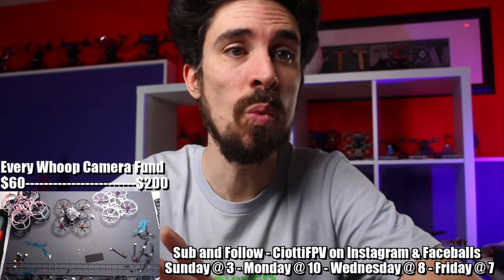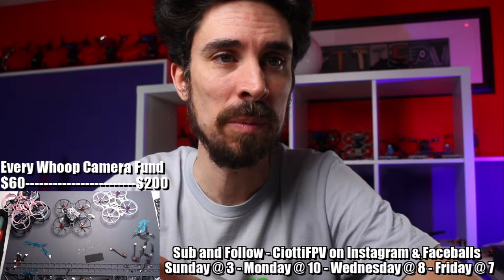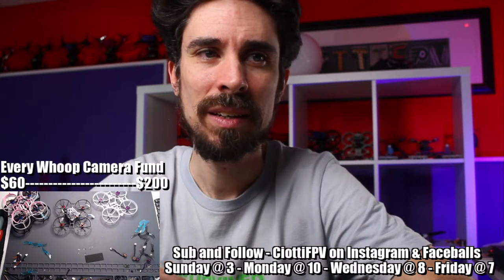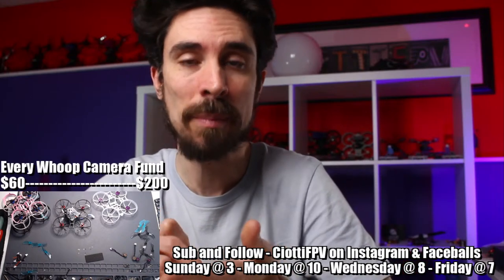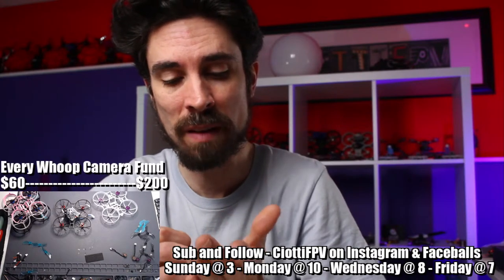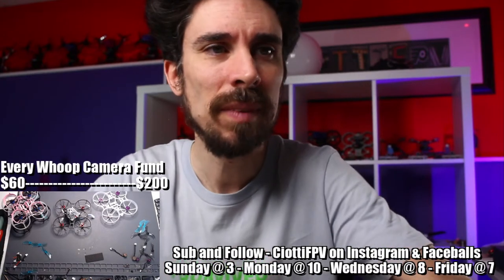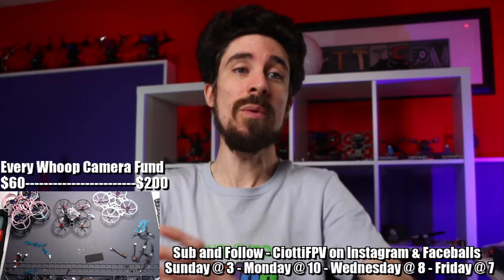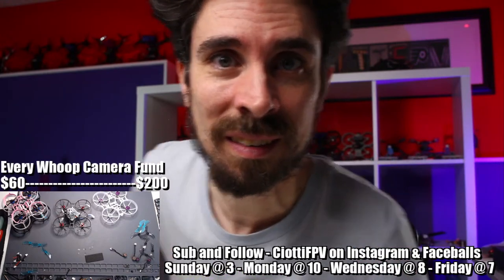Gray Hat says, HDZero claims 1 millisecond more latency than analog at 60 frames per second and 5 milliseconds less than analog at 90 frames per second. That's a silly claim because analog latency is all over the place. It depends primarily on what camera you use. There are analog cameras that'll have 30-some milliseconds of latency, and other analog cameras that have a couple of milliseconds of latency. Walksnail could make those same claims. They could say, hey, we've got 3 milliseconds less latency than analog, if you're using one of the analog cameras with 33 milliseconds latency.